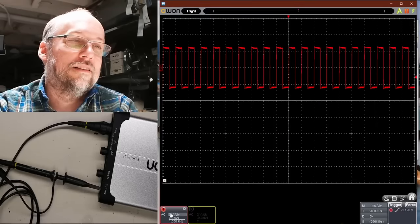In zoom mode, zooming in on the waveform between the yellow markers actually shows 100 mega samples per second, but you can't drag those lines around — it's just stupid. The cursors are available but very dim and hard to read. They do show delta values for time and voltage, which is useful when the automatic measurements aren't working properly. The interface is really unintuitive: you can't drag waveforms around, can't use the mouse wheel to zoom on the main display, and the menu pop-ups overlap the waveform.